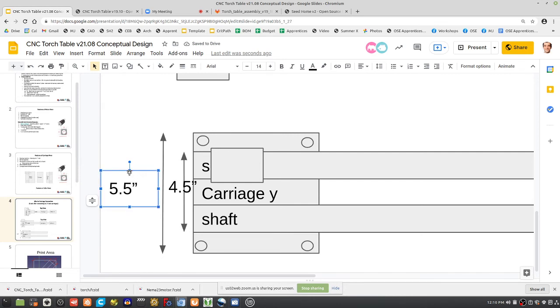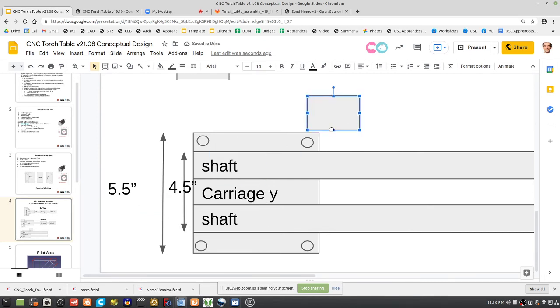That means we might have to shimmy, just move the, well, the bed size is exactly 6 by 6. So if we're printing to 6, we're printing right up against the edge, which is a little challenging. So maybe we can say we do this 5.75. Because the area that the print sits on the bed is quite large, we could do without the brim, and then you get the full 6. So we'll assume 6, no brim.